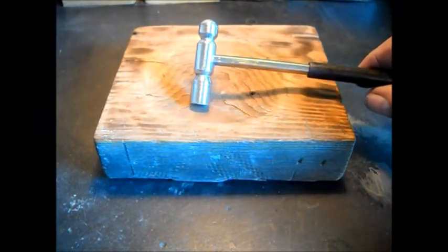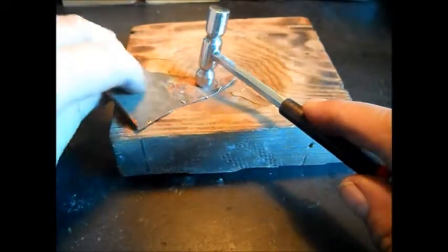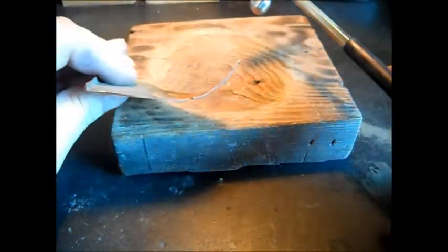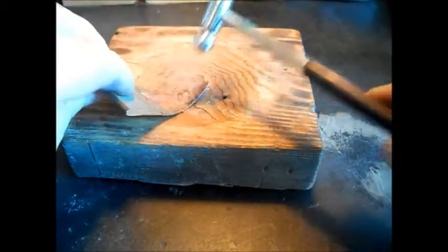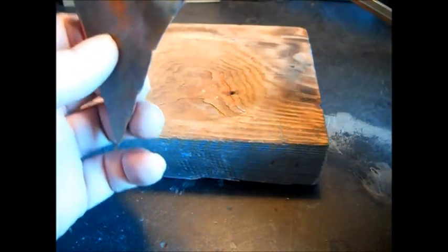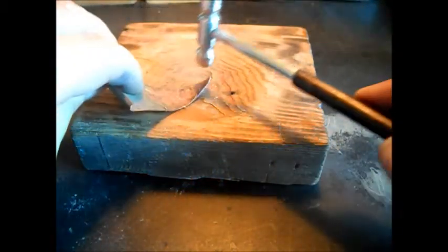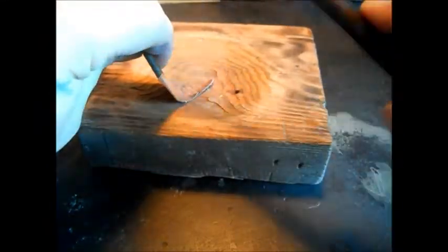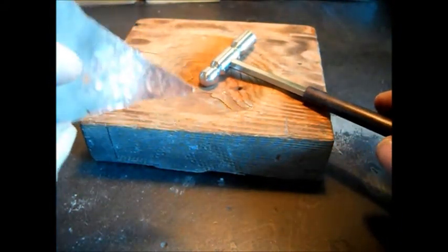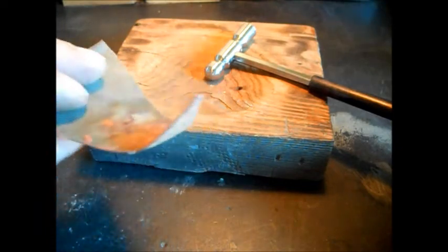There's the finished little miniature ball peen hammer. I can do small things that the big one can't do — smaller items — and it will leave a nicer look on the copper. This copper is all scruffy yet — I just heated it up to make it softer. Some of this stuff will come off as you're hammering it — the more you pound. It isn't really that hard to clean. I'll clean the side that's going to the inside, like when I made my bigger bowl — I cleaned the inside side first. The outside I didn't care what it looked like.